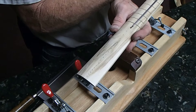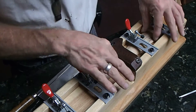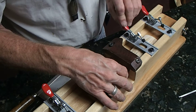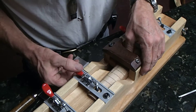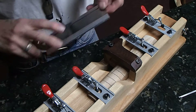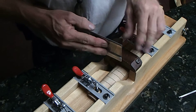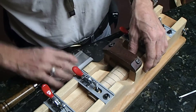We want to see a full dot showing behind our blade — it just makes it easy to align the blade. If you don't put the mark exactly where it goes, put it just a tiny bit ahead. Then we clamp down our board with our side clamps, kind of temporary. I've sighted down the edge of this block and I think that's going to be really close — just a touch more.